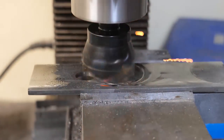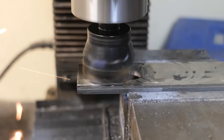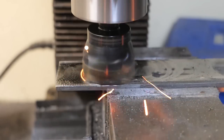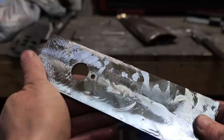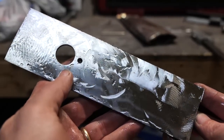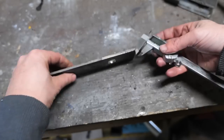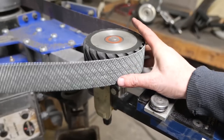I've decided I'm going to face this a little bit and see if I can get it a little flatter. My surface grinder has some issues — my ability to mill stuff has a lot of issues too, I'm just no good on a mill, so this isn't going to go incredibly well. The surface grinder wheel is worn down and not wide enough to accommodate my full iron in one pass, and it's got nicks and gouges that don't allow it to symmetrically flatten stuff. That side's got too thin a layer of 15N20 for me to do much with right now — I need to get this thing heat treated, then I'll come back and flatten that side.